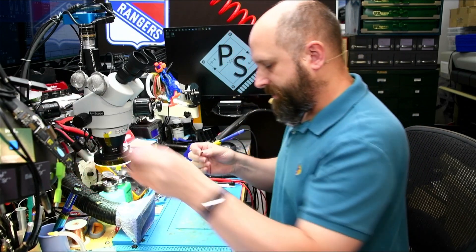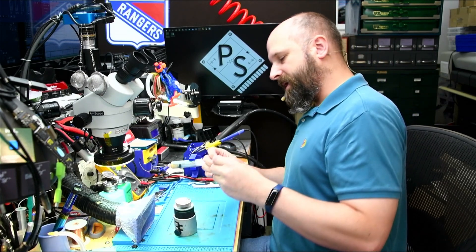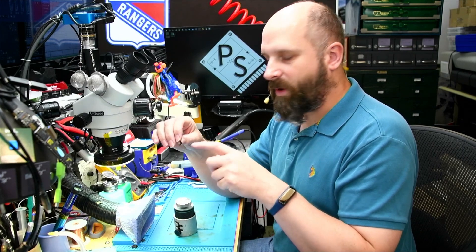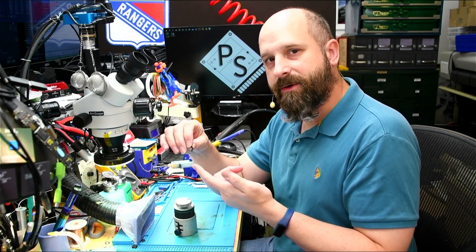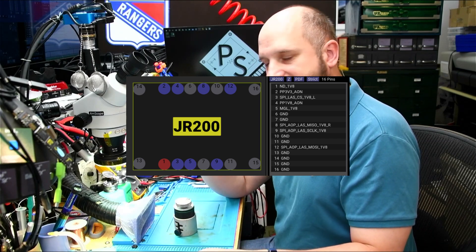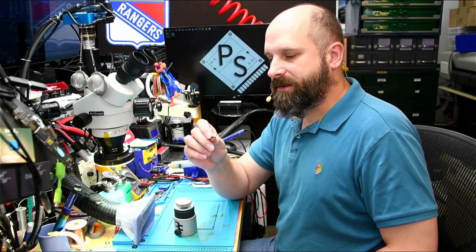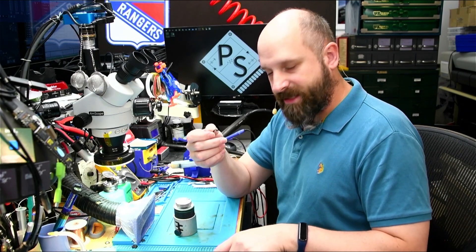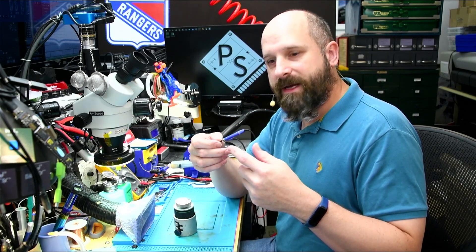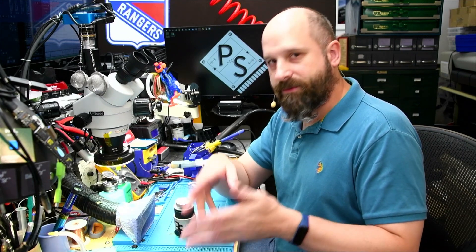We're going to see if we can fix this. There are usually two or three different ways. We can try to patch this one up and run wires for the traces that are missing, because there's always power going to this — if it sits in water, the traces just rot away. Or we can take this chip off and put it onto a donor sensor. We can get a brand new sensor, and as long as the chip is still okay, we put the old chip onto the new sensor and everything works fine, because the chip itself is what holds its zero position.